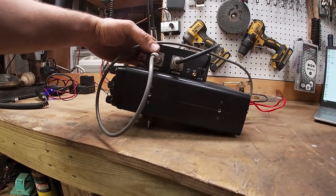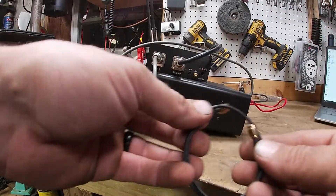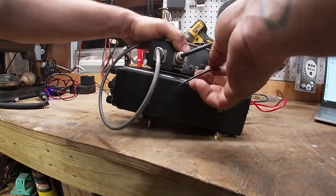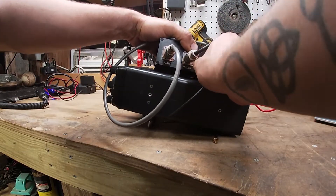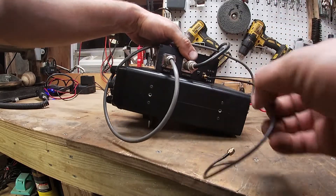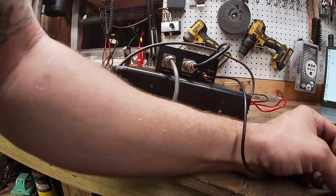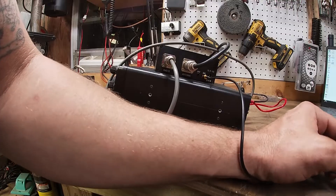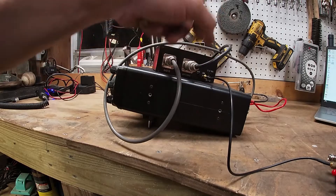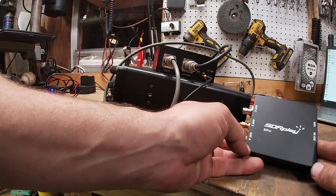On the back of the box we've got the antenna pass-through, and then you're gonna take this SMA cable. I will say with this box, this SMA input is very very sensitive. In the two I've seen, both of them have had to have the jack re-soldered because they would separate from the board or they wouldn't be soldered good from the factory. From there to there is the antenna input on your SDR.